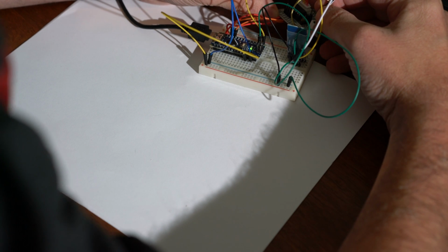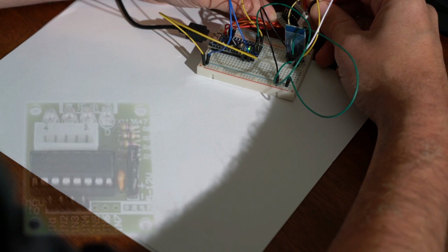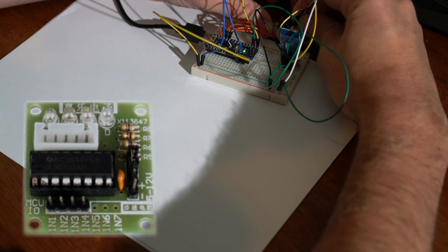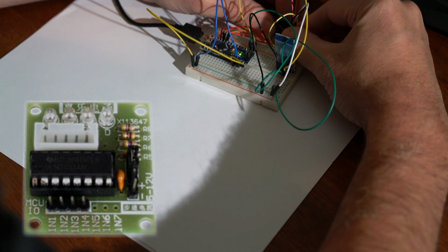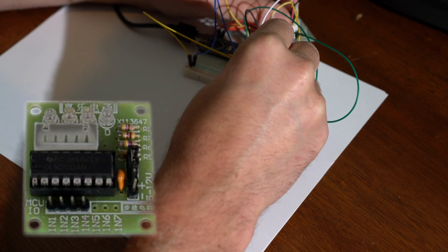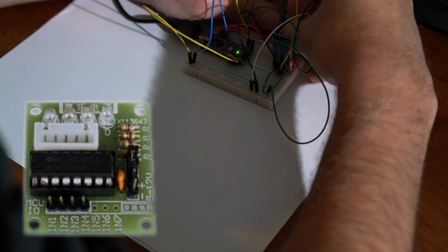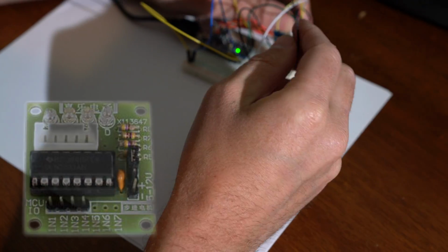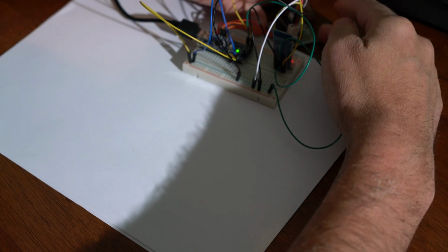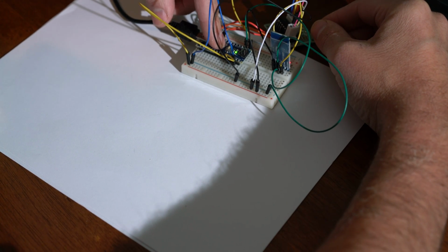So on here, this can be for 5 to 12 volts, but I think if you move the pin over it goes to 12. So now we've got it on 5, so we've got plus is the furthest away from me. I don't have a proper size jumper for this, so we'll use this guy. Prototyping. So we'll plug this into the plus rail, and this guy, that's definitely a minus, put into the ground. There we go. So that should be powered up now. Who knows?